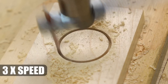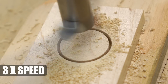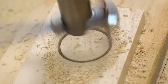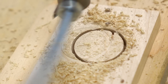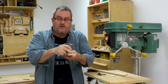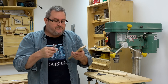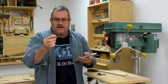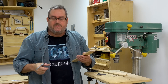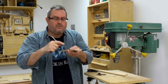A lot of people are probably saying there's nothing new here — yes, I know it's a fly cutter, but it's a homemade one, and that's what I'm showing here: how you can grab whatever materials you might have and put one together for next to nothing. What happened is the cutter itself is too wide up at the top and I got hung up in the kerf. You could see the board wobbling back and forth, which was a good indication that was happening. The better approach would be to use a heavier saw blade to cut the tooth out of — you get a bigger tooth, a stronger piece of metal behind it, and make sure what's above the tooth isn't angled like this, so it won't get hung up inside the cut.